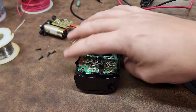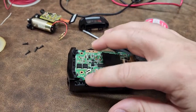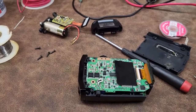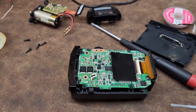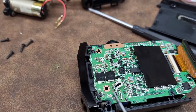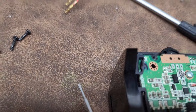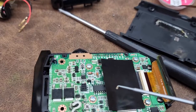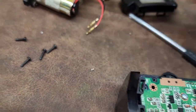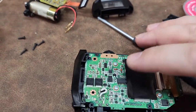This is the third and final video about troubleshooting DC electronics — this is the radar detector which had a bunch of fried components on the DC input side. I removed a lot of those components; one was an electrolytic capacitor. When it was pulled it turned out it wasn't bad, but right between those two points was this little capacitor which shorted, and it was in line with the other one, going between ground and the positive leg.